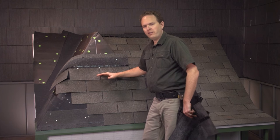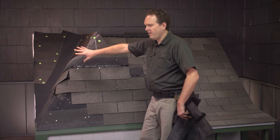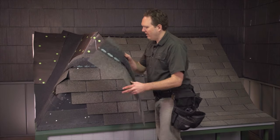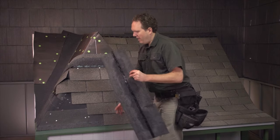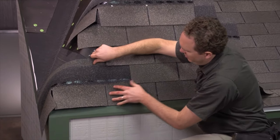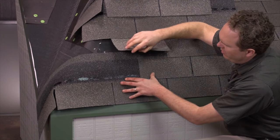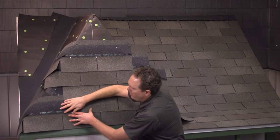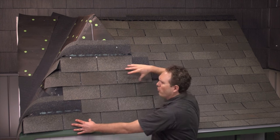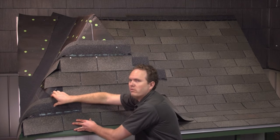I've got several courses on here. Our model is pretty small to demonstrate this, but it gives you the ideas — we've started the stair step going over this way. The shingles cover most of it with just one three-foot piece. What we've got to do now is slip this course under the other ones, and this is why you leave that other nail out — when you come back in, you've got to put the nail in the shingle already nailed over here. On a larger roof, you'll have a lot more courses: run a course, run full shingles to the right, run shingles to the left, then move up.